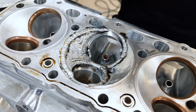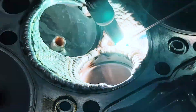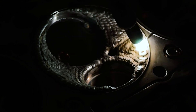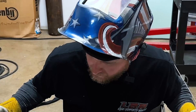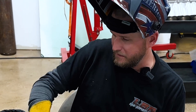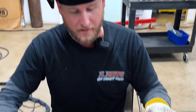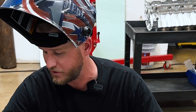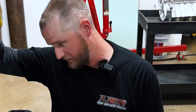Anytime there was a piece that had to be ground pretty deep, I'll go ahead and put what I call a cheater pass — where it's deeper than the rest of the surfaces — so I'll put a little metal there, get it even, and then continue on with the stringers. All looks good, welded up. It's a little trashy, but anytime you're working on aluminum that's been used, it's had exhaust and all kinds of metals from the valve and the seats impregnated in it. Some are trashier than others, but you do the best you can to clean it. This is a full chamber repair.